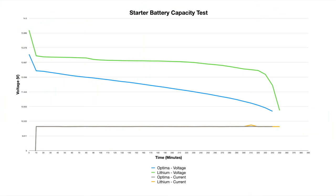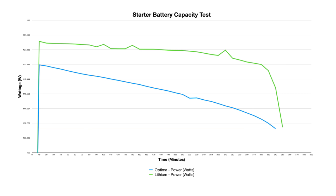Looking at the discharge profiles from that capacity test, the green line is our lithium battery and the blue the AGM. It is obvious straight away that the lithium battery holds and maintains a higher voltage through the bulk of the discharge time. The AGM, although having the same 10 amp power draw, decreases in voltage in a very linear profile. Looking at power output in watts, because we are drawing a constant 10 amps and voltages are differing, the power output is also different. We are getting more power in the form of watts from the lithium battery, starting at a difference of only 6 watts at the start and extending to a difference of 14 watts at a lower state of charge.